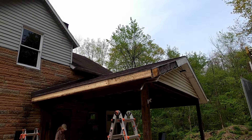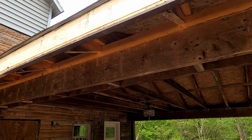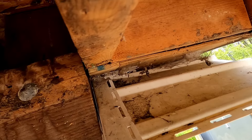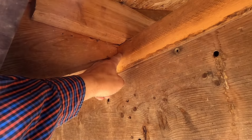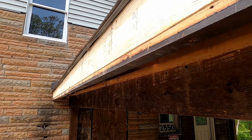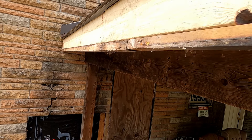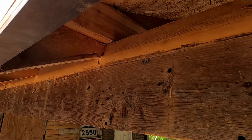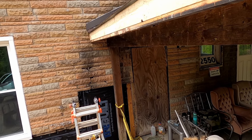It's amazing how much better it looks just with a piece of two-by up there. They only had a piece of one-by across and then quarter-inch blue plywood over the top. When they cut the tails - the bird's mouth - they didn't cut them all the same. We ran a level and it's pretty much straight with the post and header, but you can see some of them stick down a little bit. It's solid, it's not a bad build - pretty level and fairly straight.